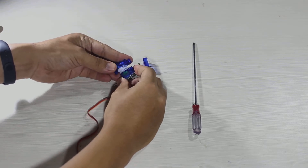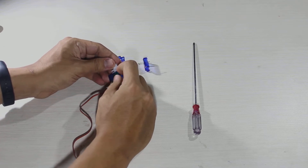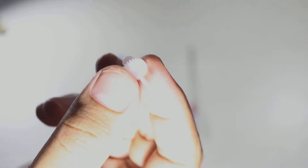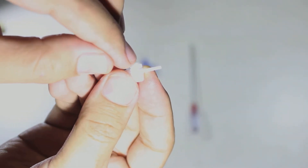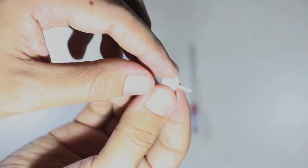To find the limiter, we will first open the top case and then pull out the gear. After that we will find the limiter. This is the top gear and there is the limiter — you can see it prevents the motor from rotating more than 180 degrees. Now I will try to cut this limiter using a cutter.